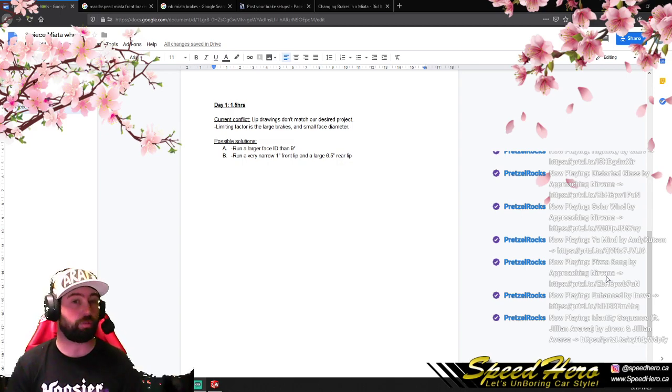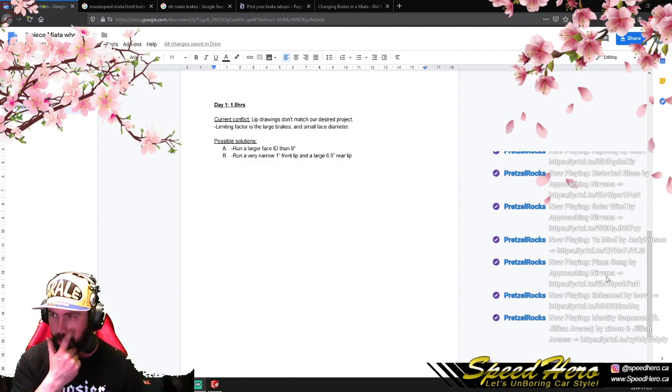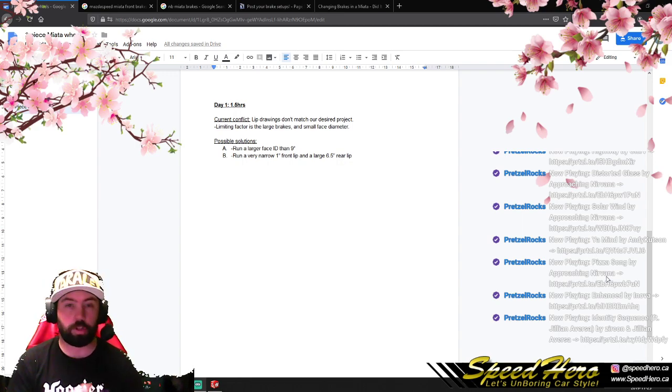It's like going to the store and buying screws. You can buy an M8 screw a lot cheaper than maybe an M7. Even though the 7 is smaller diameter, there are more manufactured M8s than M7s. M7s aren't really desired or commonplace. So even though the larger diameter of the 8 should be more expensive, it's not. It's produced more. And so there are certain diameters of aluminum stock that are used more commonly. A 10-inch stock is used very frequently. There are tons and tons of people using 10-inch stock. But a 9.5 or an 11-inch stock might be way more expensive, because there are very few people purchasing those sizes.